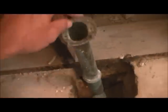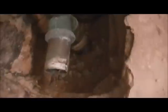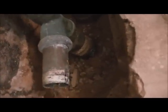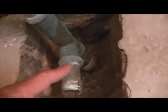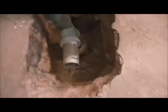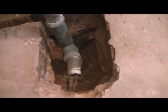Getting back to the tub area — the tub is usually anchored by virtue of being plumbed in, which is what happened here. This is the old pipe. The tub is drained with a P-trap below grade on a concrete slab like this — the P-trap you can see down there is below grade, buried in the dirt. Therefore we don't need a new P-trap for the shower because it's already there. However, we do need to transition from this inch-and-a-half pipe to two inch for a shower drain, and getting that done on a slab where you don't have much room is always kind of fun.